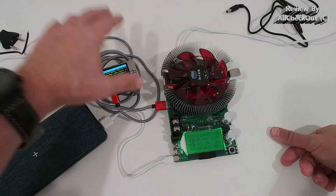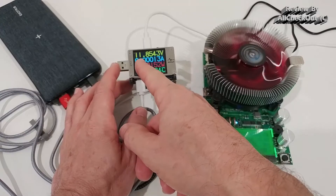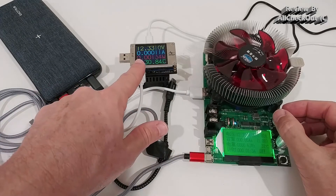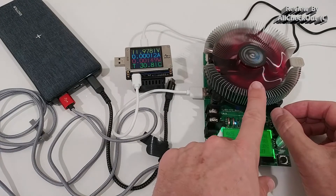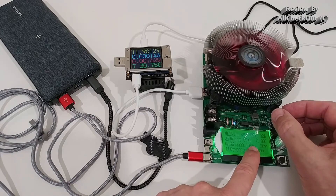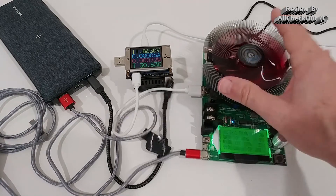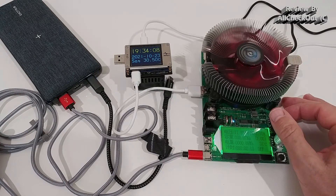So with 12 volts we could go into this load module here — now it needs an additional power supply, but we can do the load test. The consumer is this load device, not the trigger module. We can use this device as a Quick Charge trigger — I've triggered Quick Charge 2.0 to 12 volts — and use the load tester as the consumer separately. It's not consuming power on its own, it's powered externally. It registers everything: watt hours, amp hours, milliamp hours. We can definitely test this way, but we need an external trigger — there's no built-in trigger unfortunately.